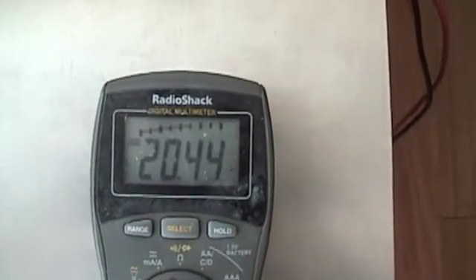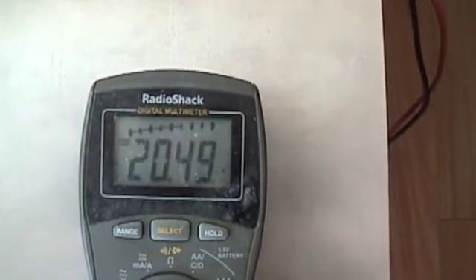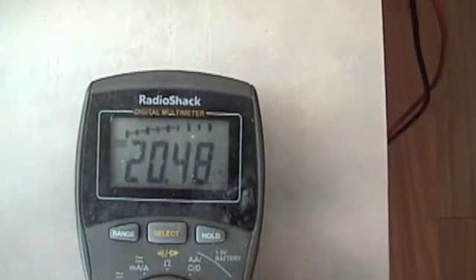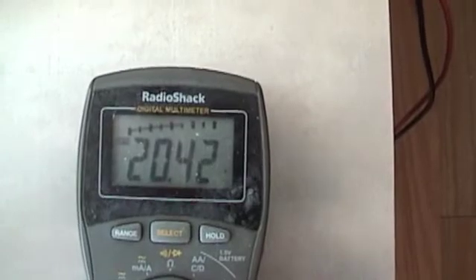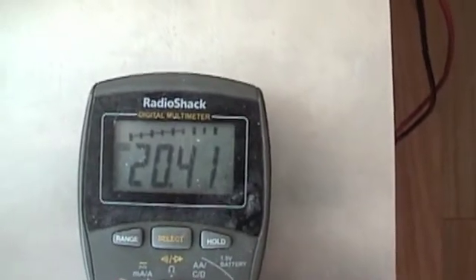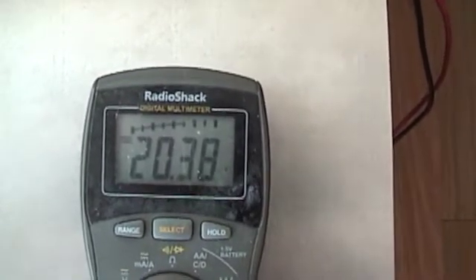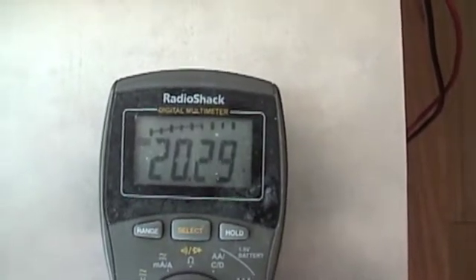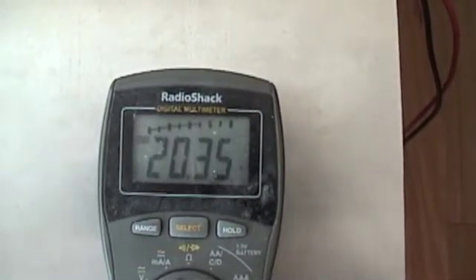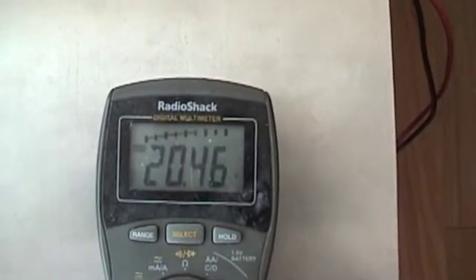This is doing exactly what I was hoping. Got the GTI putting in 240 watts into the wall. It's a 24-volt battery bank and the turbine is in parallel with the battery. So what's happening is I get a little gust, voltage shoots up, and when the wind dies, voltage drops a little bit.